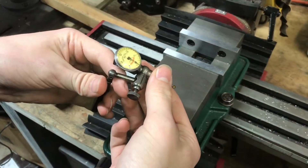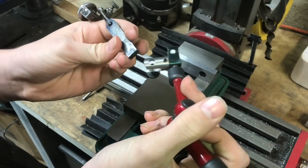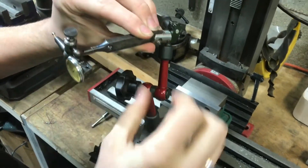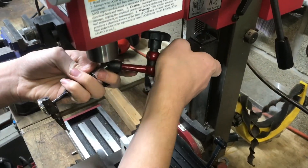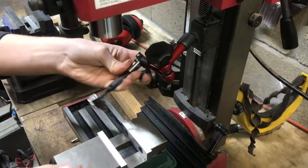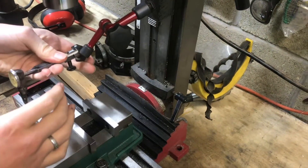We'll put the mount in. We machined a little adapter so that this will fit in place, and then we're able to tighten a set screw here. The fit is already pretty tight, and the screw really seats it in there. I'll mount this in a stable position right here on the back — that's held on with a magnet. With this loose, it can move around in just about any position I need.